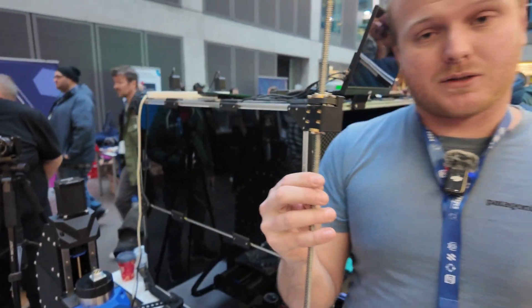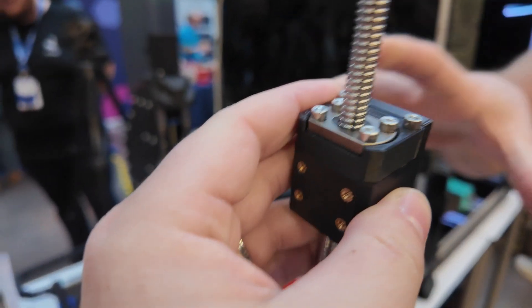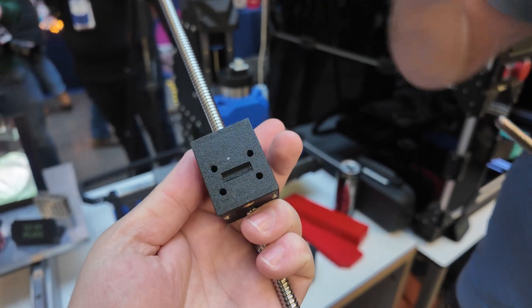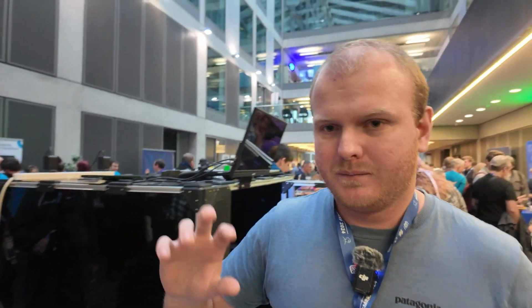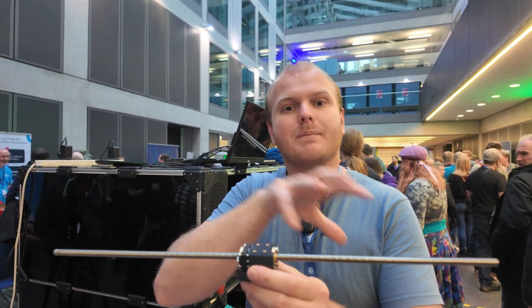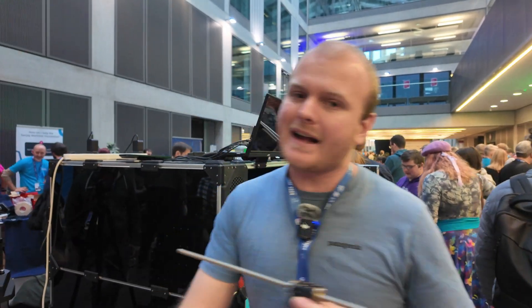There's now the option of either a standard TR8 lead screw or 0802 ball screws. Lead screws are easy to install and run cool but have a low lead angle so they won't be fast. Each block can be used on any axis — you can mix and match, having a ball screw on z, a lead screw on y, and a ball screw back on x.